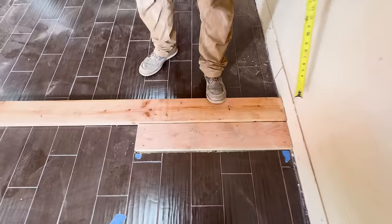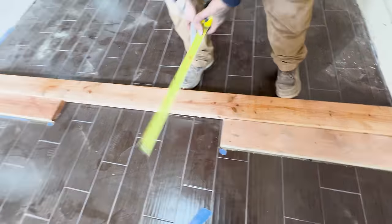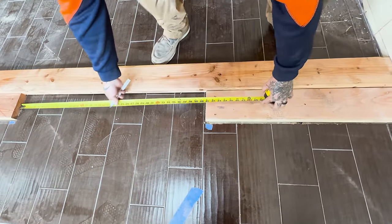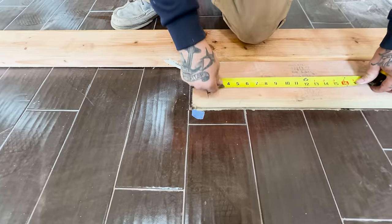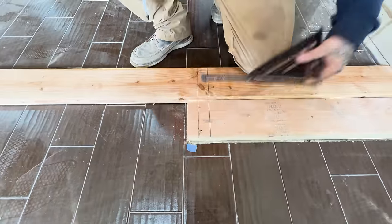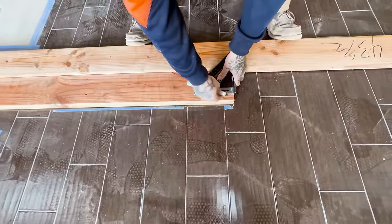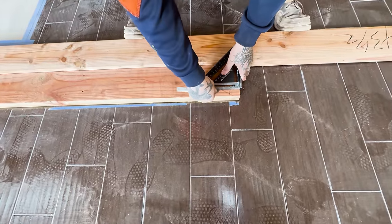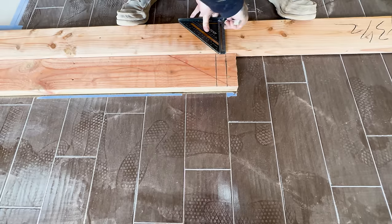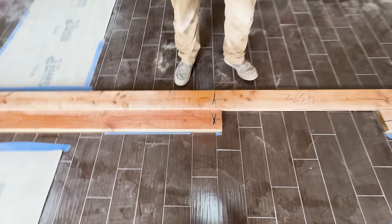And the same thing here, we came off the wall, I believe it was 32 inches, yep, to our RO. RO is 40 and a half. These plates are perfectly spaced. That means all we gotta do is pull 1.5 inches, 3 inches. First one's for our trimmer. Right, our header on here, 43 and a half. Same thing out here. We got 1.5 inches, we've got 3 inches. It's gonna be nice, we don't have to cut our plates.